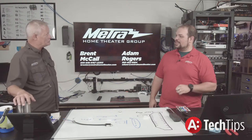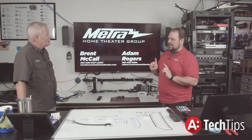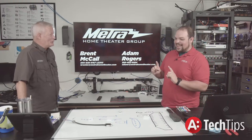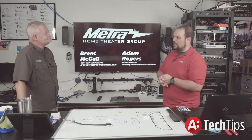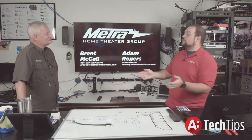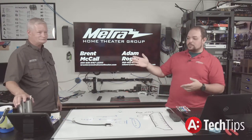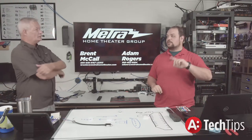You and I talked about a tech call yesterday and I completely blanked on it, so let's talk about what happened to us on the job. Primarily it came down to the fact that we burned out an AOC cable. First and foremost, I need to come clean — it's something that I caused. On our AOC cables — our original V-LOX AOC — they have a USB power connector on both ends, and it is required to have power inserted.